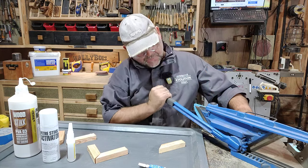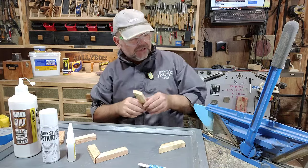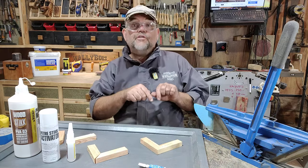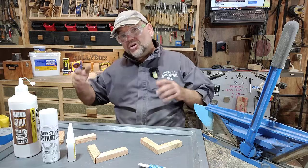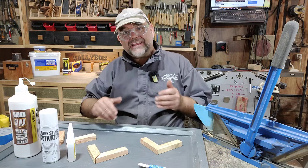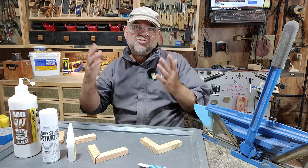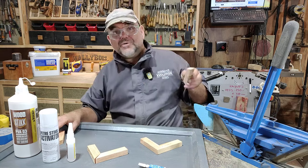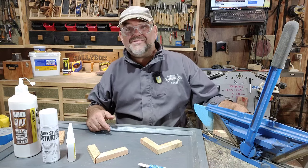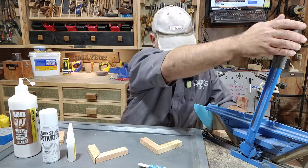The other thing about using one of these mitre trimmers is that it is set pretty much perfect how I want it, all adjusted up for 45 degrees. Which means when I do four 45 degrees, one, two, three, four, like a picture frame for instance, they tend to go together a lot nicer. You don't end up with the last joint being way out and having to trim up all the other mitres to try and make that one fit. If it's set up correctly, you don't need to. Some people are going to say you can do that with a mitre saw. No, you can't, not like this. So I definitely recommend them.